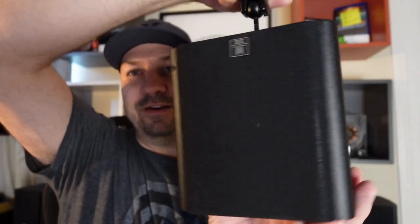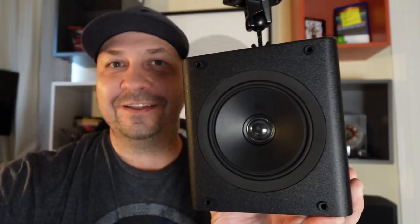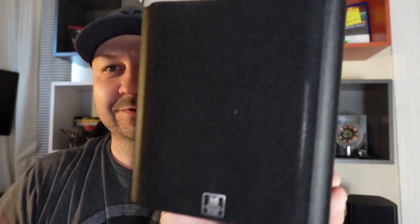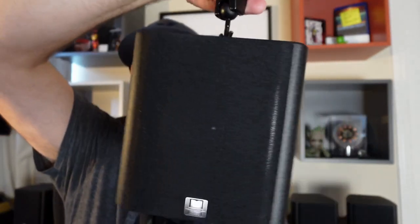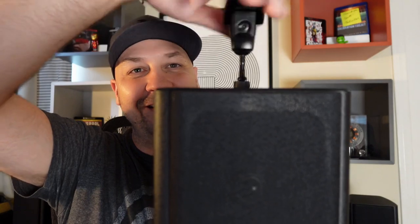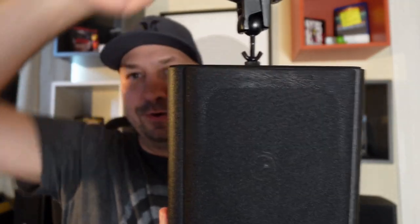You thread the adapter right in and the mount sits nice and flush on the ceiling. You don't have to worry about the front grill — these easily flip over so the speaker will hang properly. For the ceiling install, I'd still suggest adding some kind of safety strap for extra security — just loop one through and back over in case anything ever lets go. That said, I'll be going into ceiling joists or 2×4s for a secure connection, or putting in serious anchors.